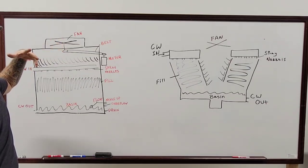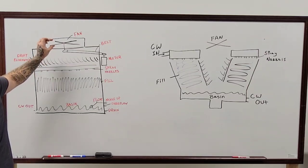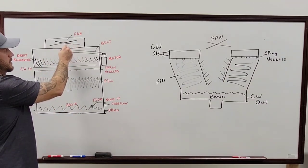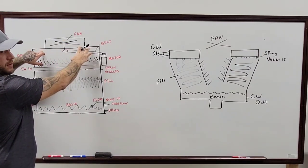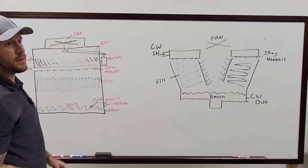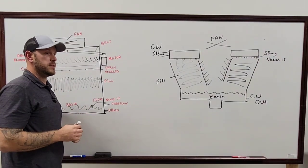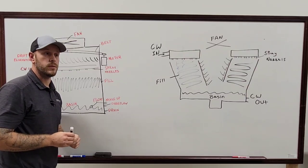But on most of your ones that have it, it's a gearbox, right? Isn't that what that's called? Yeah. You have some of the towers that we walk into, where you have the motor sitting in front here, then you have the gearbox here that goes up to the fan. That mechanical beam that's running all the way across, if that becomes loose, that throws that whole fan off, motor, gearbox, everything. And then on those gearboxes, it's actually super important that you check the oil in those things. If they're dry, it's bad news for that whole system, and probably that motor too.